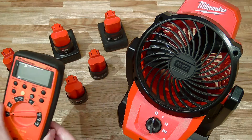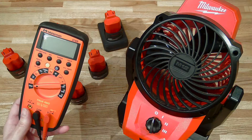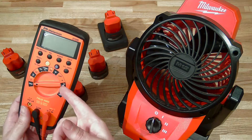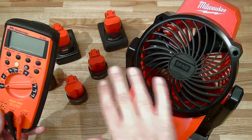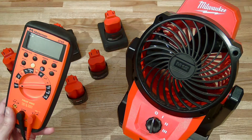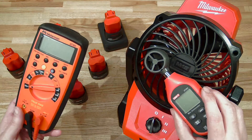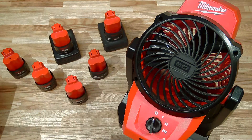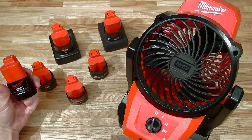That's going to be the first set of tests. To evaluate performance we're going to hook up some test equipment and monitor voltage and amperage — volts times amps gives us power provisioning to the tool. Do these batteries give differing amounts of power? We're going to measure wind speed and see whether there's any difference whatsoever.